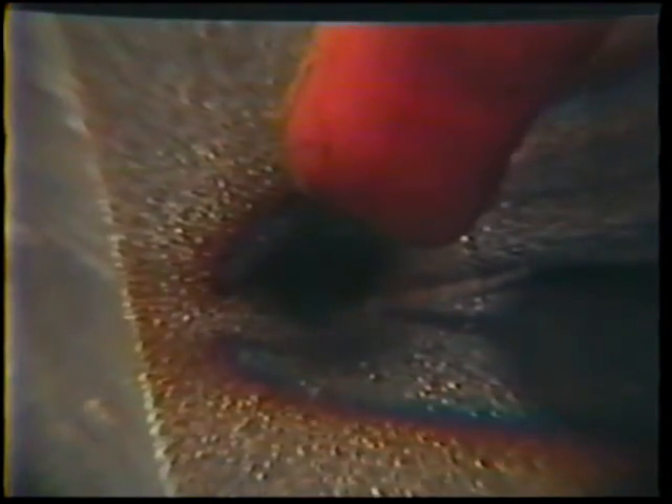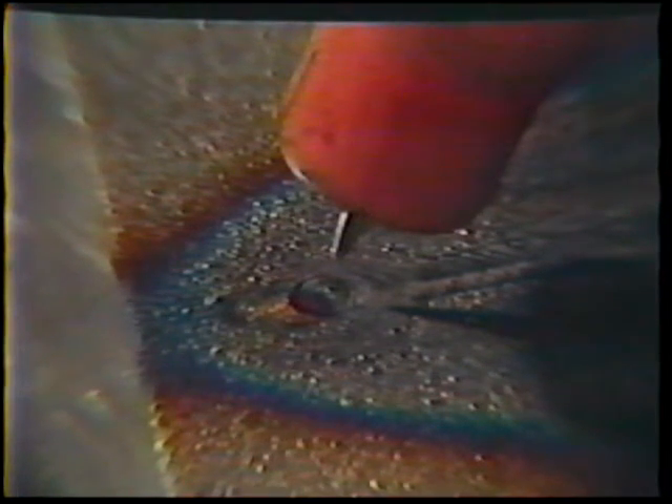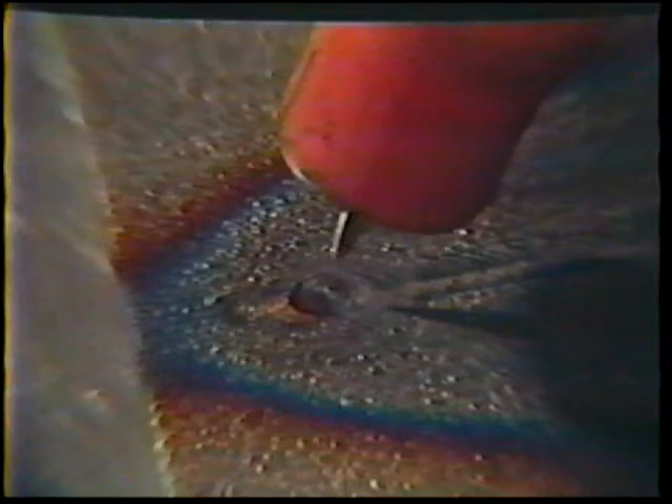At the end of the plate, release the foot pedal to stop the arc, then hold the torch stationary for a short time in order to post-purge the weld as it solidifies. The finished bead will look like this on the face: flat or slightly concave, and about one electrode diameter wide. On the back side, there will be a slight bead.